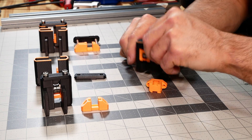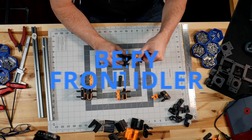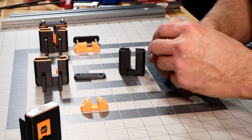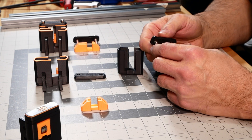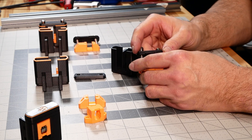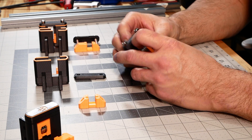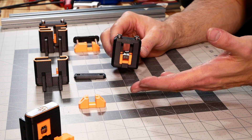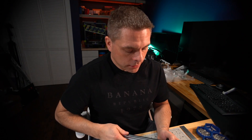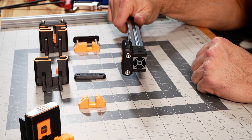Suggestions are to go with what's called a beefy idler. This is the beefy front idler. It has a mod to use a pin in the center as opposed to a screw. The carriage or section that rides inside of it is a lot more hefty — it's larger, more heavy duty. It uses M5 screws as opposed to M3 screws, which is nice because when you go to tighten these up, you really feel it works really well. But this had some downsides. The problem with the beefy idler is it's designed non-symmetric, meaning on one side it hangs down and on the other side it hangs up — so no matter what you do, it's always going to look a little lopsided.